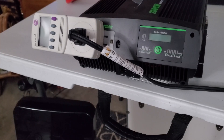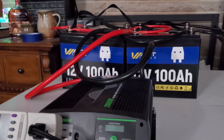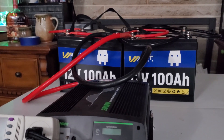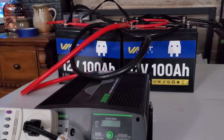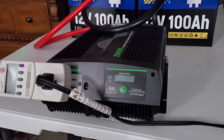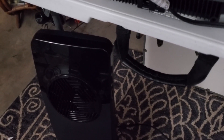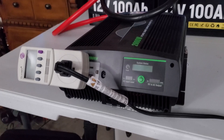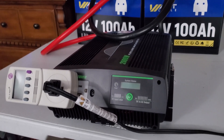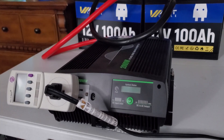5,444 watt hours — I ran that 1,300 watt space heater for exactly four hours. And that's what you can do with four 12-volt 100 amp hour batteries from WattCycle and a 2,000 watt inverter from Jupiter. That's how you can do what you need to do in order to protect yourself and your family during a power outage should you need it — one of many ways to be stacking your preparedness for whatever life throws at you. Have a wonderful day and we'll see you on the next video.